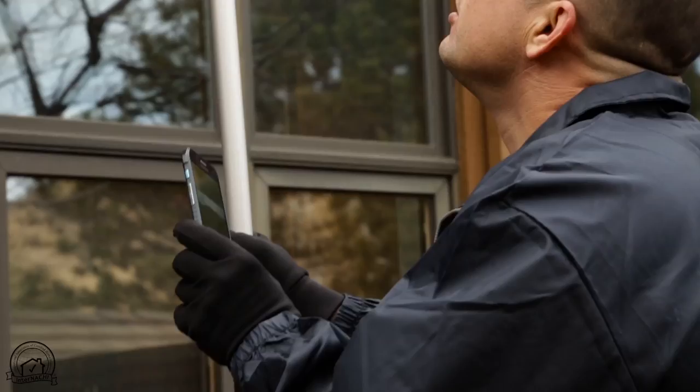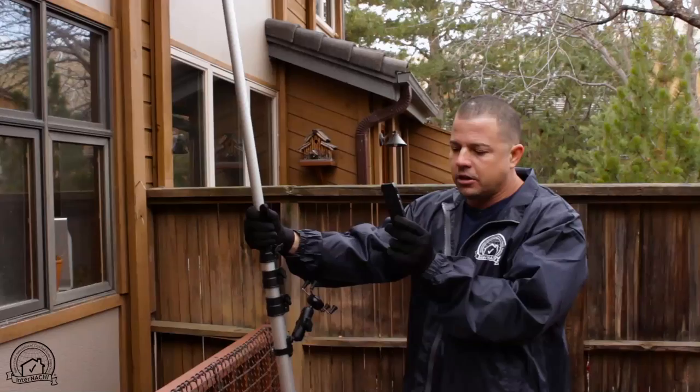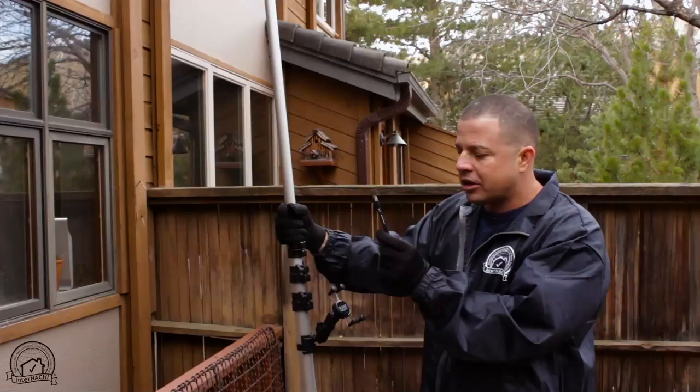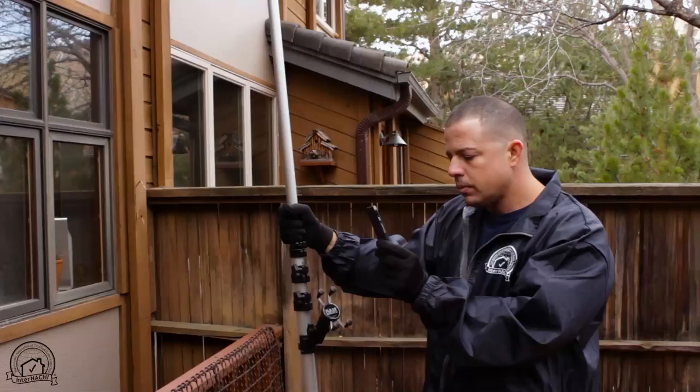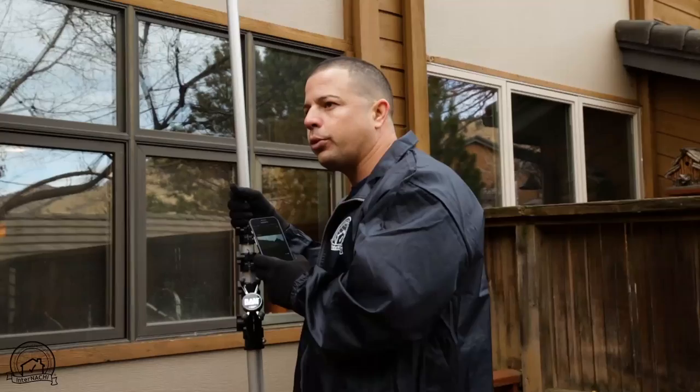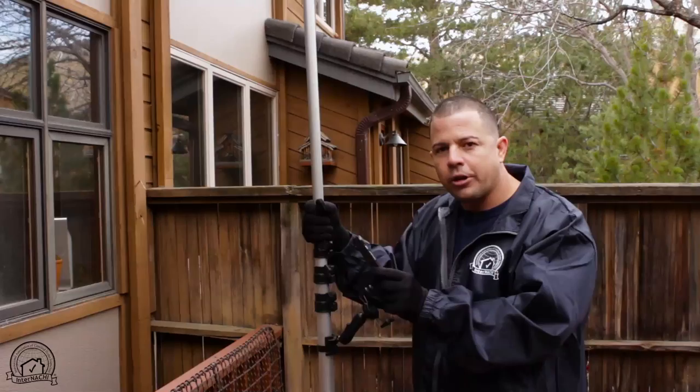Using the camera here, I can see the roof, I can see the gutters, and I can see there's a good amount of debris on the gutters, so we're going to put a little tip to clean those gutters up. We can see the chimney exhaust there and they look like they extend the right size. Often one of the safety things we find is that the combustion chimney exhaust for the gas heaters or water heaters doesn't extend long enough on the roof — those are safety things we have to note on the report. With the spectoscope, it makes our life a lot easier.